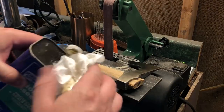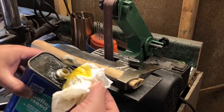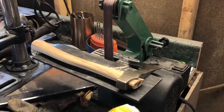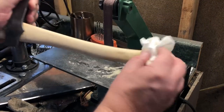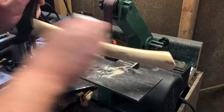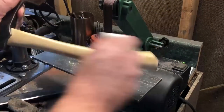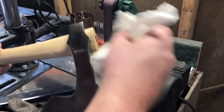To finish the wood, I used boiled linseed oil and applied a couple of coats. I won't go into a lot of detail on that process — it's pretty self-explanatory. I will say that if you're working with boiled linseed oil, you have to be careful about how you dispose of the rags you've used. I'd recommend rinsing them with water and then leaving them to dry in an area where there are no flammable materials around, and make sure to give them enough space so they can air out and that heat isn't going to build up.